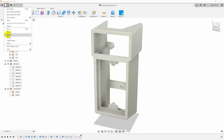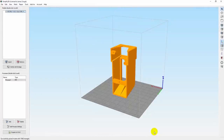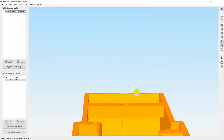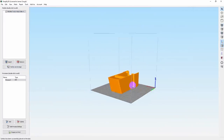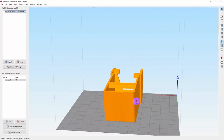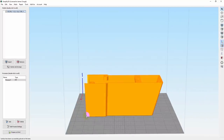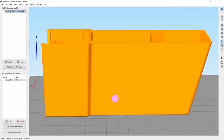Let's go to File > 3D Print and send this over to Simplify 3D. The 12-inch printer profile is loaded. I'll hit Ctrl+L, select the front surface, and place it down on the bed — center and arrange — so we're printing on the flattest surface. This is kind of the worst-case scenario: the part is about 200 millimeters long with long solid sides with strands going the full length, so any shrinkage at all will tear it off the bed. That makes this very difficult to print even in PLA or PETG.